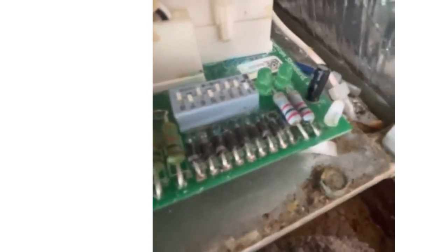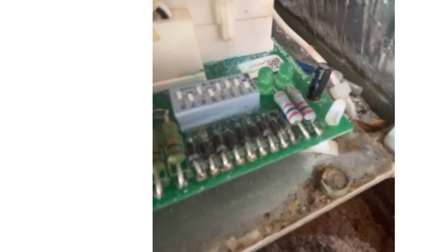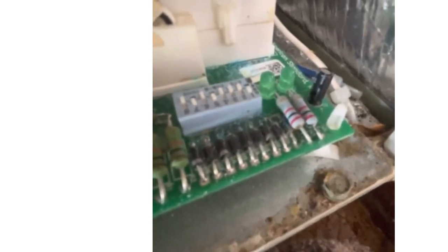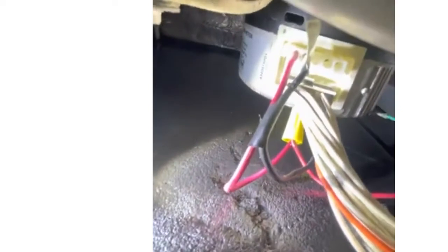So I went from 1 down to 1 up to get it to 4-ton normal, which is about 339 CFM per ton. I think it comes out to like 14 something. That was probably the reason why we have tons of water in here. That is all for today.